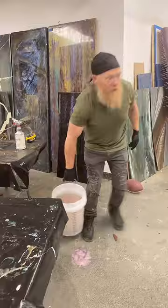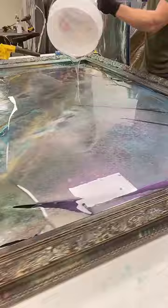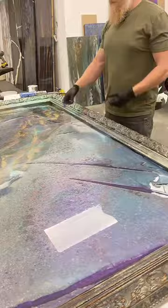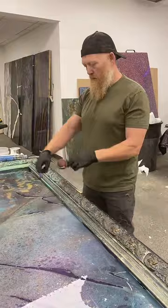I'm going to start out by pouring this out on here. This is four and a half gallons of our casting resin. This is unique — it might be hard to see the big fractures. I poured this on top of plastic that I'd stretched and torched to make big wrinkles. Then we poured resin on top and let the wrinkles protrude through, then peeled the plastic off so the color would leave these voids. Now I'm pouring clear with a few colors so we can put backlighting on it and see big crisp fractures.